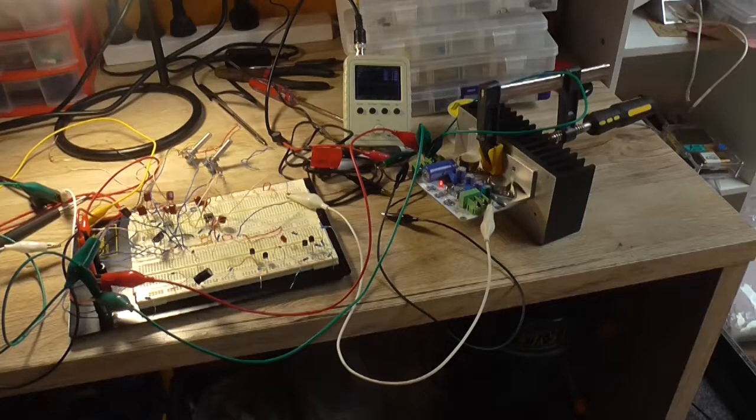Most of that rattling is coming from the speaker driver, and all that noise is coming from the power supply because the audio lead for the guitar is jammed under the power supply. It's not pulling off the desk, but yeah, it works. As I say, I might want to tame that gain just a tad on the guitar, because this was only going on 100 millivolt, and this guitar is quite capable of around about 400 millivolt peak to peak out.